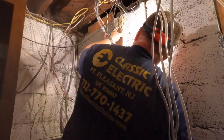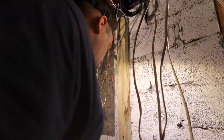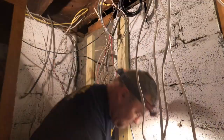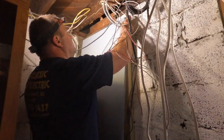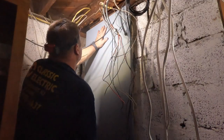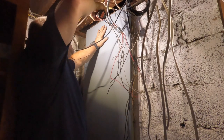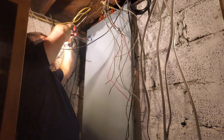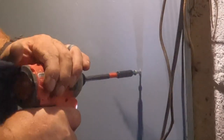I'm using pressure-treated 2x4 lumber here. Today I tried something I don't normally do — drilling with a 3/16-inch hammer drill bit into the cinder block and using 2 and 3/4-inch blue concrete screws to attach the wood to the cinder block. Once that's sturdy, I mount the 3/4-inch painted plywood to the 2x4 using inch-and-a-half wood screws.